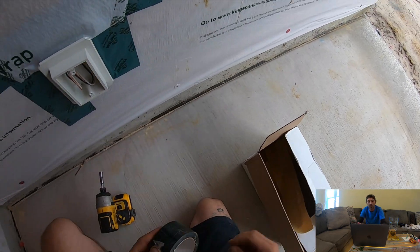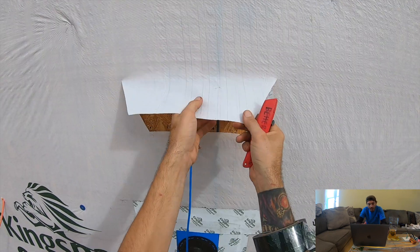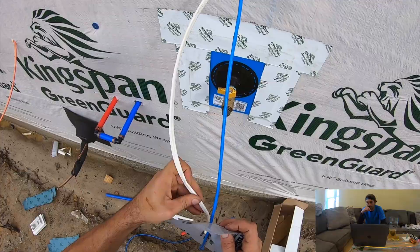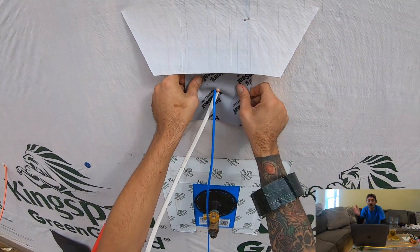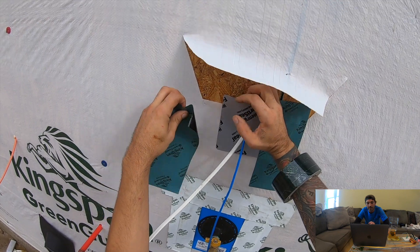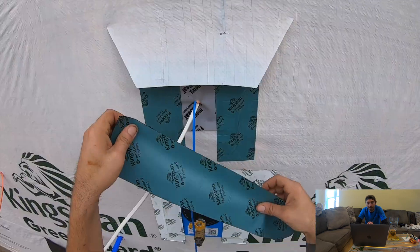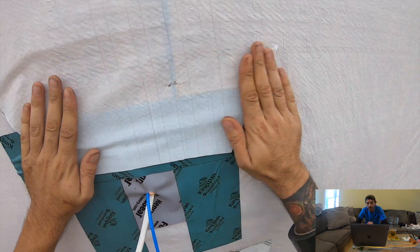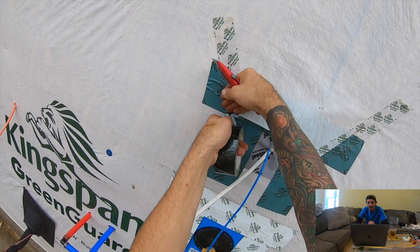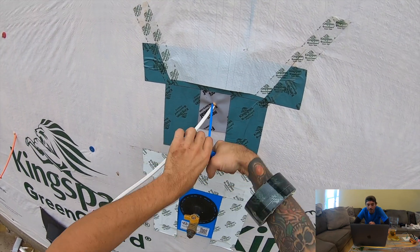We're using green Tyvek tape — it's usually just for house wrap and you can find extra on job sites. This location is for the water heater; I have a power wire and a signal wire so you can go into the garage and change the temperature of your gas water heater. They make flashing for that too — same thing: one piece on each side, one on top. Once I'm done with these low-volt wires I like to roll them up just to get them off the ground so nobody trips and yanks anything out.